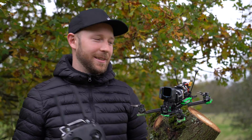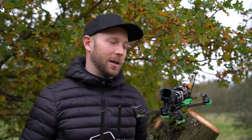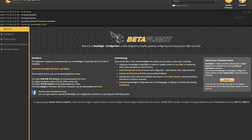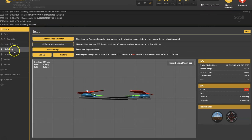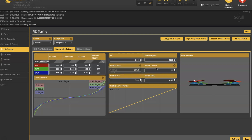Upgrade number five — by far the best one and it's absolutely free. The iFlight XL5 and the Nazgul actually come from the factory with the throttle scaled to 75 percent. I believe this is just to make it a smooth aircraft, nothing too crazy. But if you go into Betaflight, go to PID tuning, then Rate Profile Settings, and turn the throttle scaling off, that gives you an extra 25% throttle and turns this aircraft into an absolute animal. It's significantly more power, so be careful — but if you're ready for it, highly recommended.